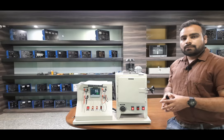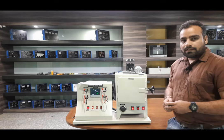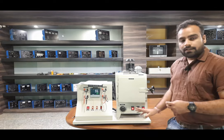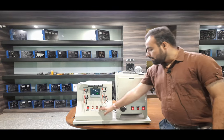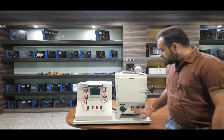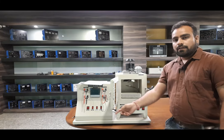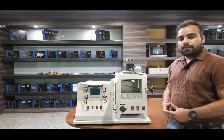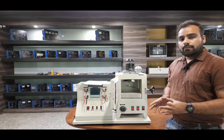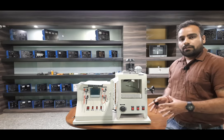After completing your practical, first close the heater switch so the heater is properly in off condition, then turn off the heater from the cabinet side, and turn off all the rest of the switches. Open the cabinet for cooling down the inside temperature. When the temperature is completely cooled down and reaches atmospheric temperature, you can move this machine to a safe place.